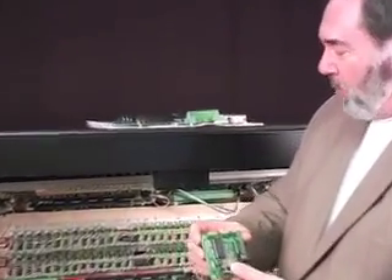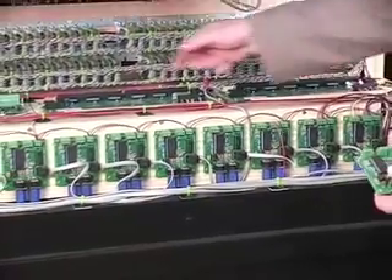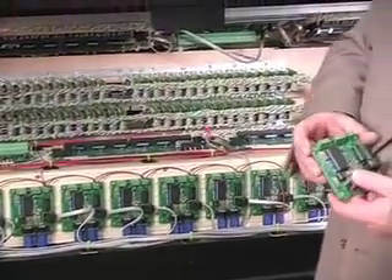The micro MIDI board is really the entire brain center of the control system. If you look very closely, you will see that these micro MIDI boards are located across the back of the organ and each one has a different purpose. The ones here are wired into driver boards that actually run the magnets on the stops. This is for a combination action — as you press a piston, you will have groups of these stops turn on to select the combinations that you want for your music.